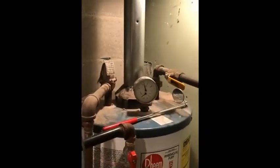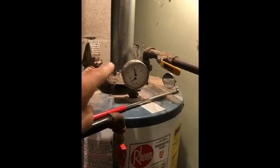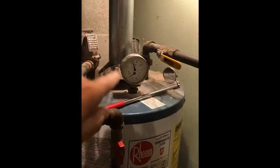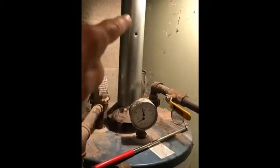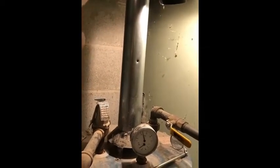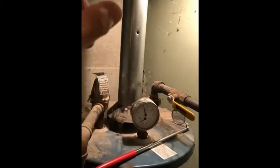The other device — and this is the one we're going to focus on — if you have one of these in your house, you'd recognize it by the metal vent connector. It's called a vent connector because it connects the appliance to the actual vertical vent or chimney. This vent connector is nice and straight, about 18 inches before the first elbow, then short into the actual vertical vent, to convey combustion byproducts up and out of the building.